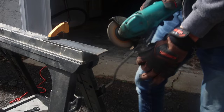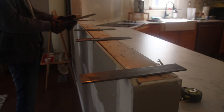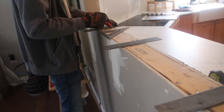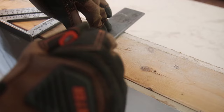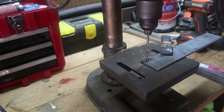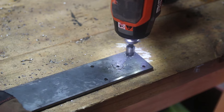I just cut up some flat stock steel that I got at the big box store using an angle grinder, then I used a grinder to take the sharp edges off the steel. I also went in with some sandpaper to get it even smoother so the lines would look nice when I painted it. I laid all the bars out where I wanted them, marked them on the top of the wall, and then countersunk them into the top of the wall. I used a drill press to drill the holes out, then went in with a countersink bit so the screw heads would sit flush with the steel.